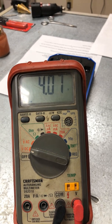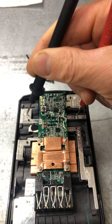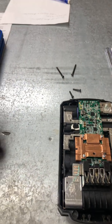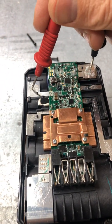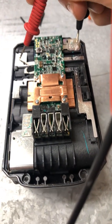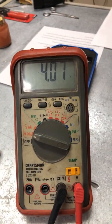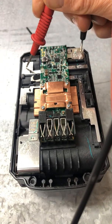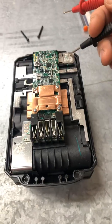Looking good. It took me two days to balance this because I did it with my little charger board, just reversing again. Positive here, negative here — as the last cell. I had to balance three cells at two amps, so it took a couple of days.